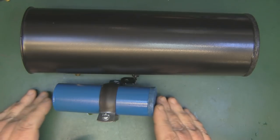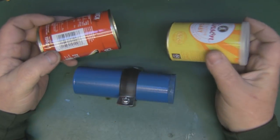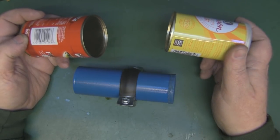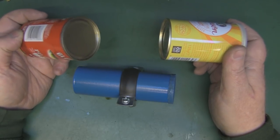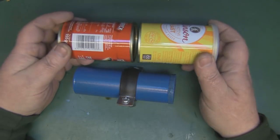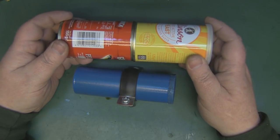When making this, you really have to be spot on with those measurements - just a small fraction of a millimeter out can make big differences. It's certainly not as forgiving as 2.4 GHz. For the second video, I'm going to make a cantenna from supermarket cans, the closest I can find at around 40 millimeters - though these are almost 55 millimeters in diameter. I'll join two together and then do a comparison shootout, plus test both on the spectrum analyzer.